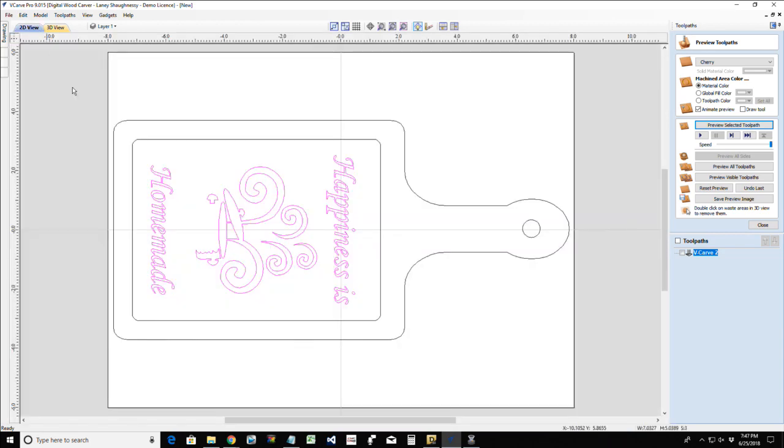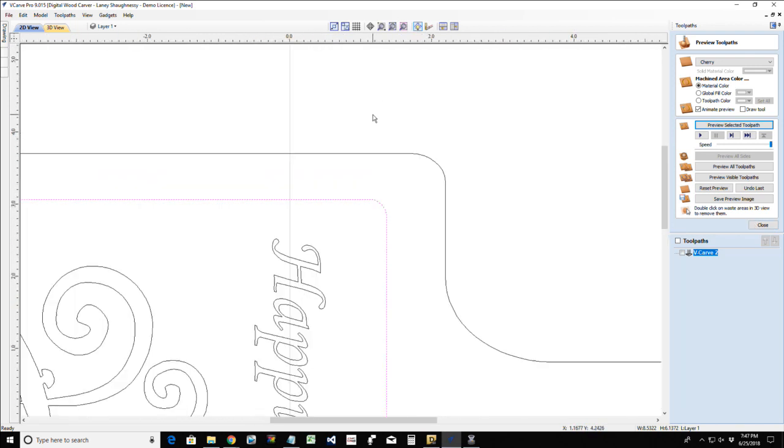All right, so let's talk about our juice groove. Typically the juice groove is cut with a box core router bit, and it is in many ways similar to a ball nose. Some manufacturers call them round nose bits. I know them as box core bits.